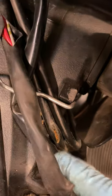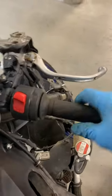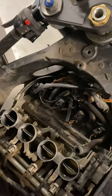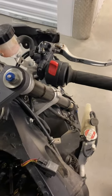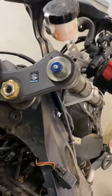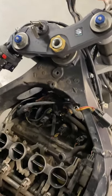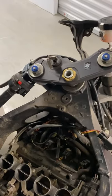So yeah, that's pretty much it. You want a nice throttle so when you release it, it snaps shut right away — for emergency deceleration or just getting off the throttle quickly. You don't want any slow return; you want it to be as quick as factory. Like I said, two wheels — if you ride hard, make sure your machine is in tip-top shape. We don't want any problems.